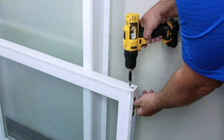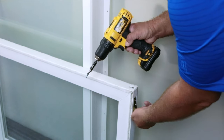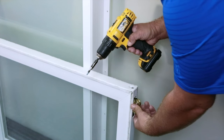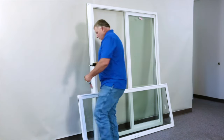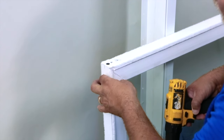The top screw is what releases the roller assembly. Make sure to hold on to the roller as you release it. Insert the rollers and reattach at the other end of the door in the same manner.